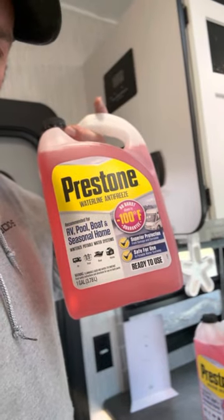If you want what they call a winterization package for the different valves and bypasses, most RV places can install those for you if you're not comfortable doing it yourself. But this stuff is actually pretty easy to do. The first thing you're going to need to get is some RV antifreeze — not automotive antifreeze. This is meant to be in your water system; it's not toxic if ingested. Most trailers you can do it with one, maybe two gallons if you've done it properly.